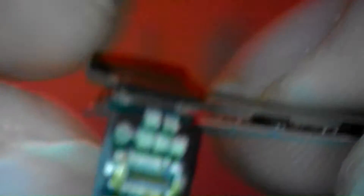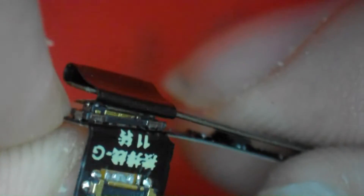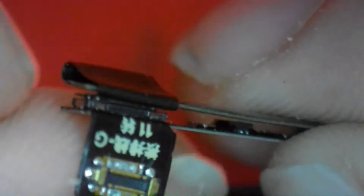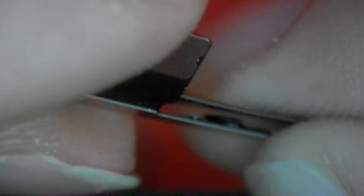This is what it looks like with the tag-on flex folded back — you can see the two FPCs. I'll disconnect and reconnect this a couple of times so you can see how that works. The original flex is tucked behind itself, plugs directly into the tag-on, and then you fold the tag-on connection back. That's basically it for this step — we'll move on to unwrapping the battery and prepping it to remove the BMS for spot welding.